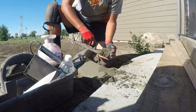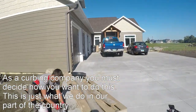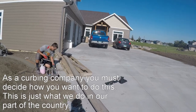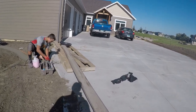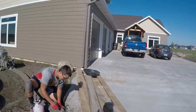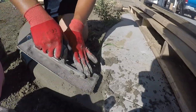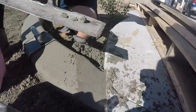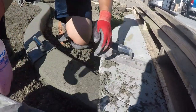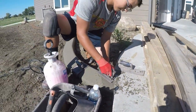We're on a driveway here in North Dakota — you're gonna get all sorts of snow, people use snow blowers, skid steers and things like that. We don't do any curbing going lengthwise along the edge of a sidewalk or driveway because nine times out of ten that's gonna get destroyed within a couple winters. He's angling that down a quarter inch to a half inch below the lip of the concrete itself, thinking about people running their shovel in winter — that shovel goes over the edge but still doesn't hit the concrete.